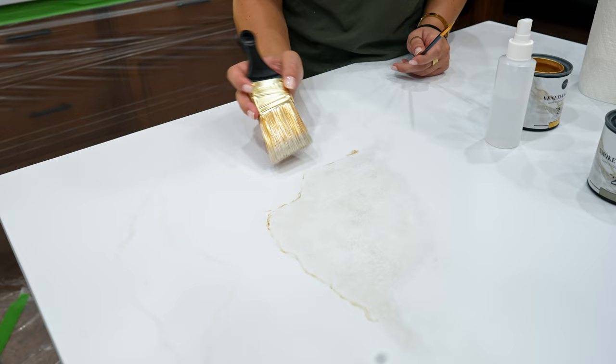Once you've finished applying your epoxy, grab a bright light and closely inspect your countertops for bare spots, bubbles, and lint. For air bubbles or lint, use tweezers to gently pop the bubbles or pull out the piece of lint. To fix a small bare spot, use a 2-inch brush to drizzle a little epoxy onto the spot and dab lightly.